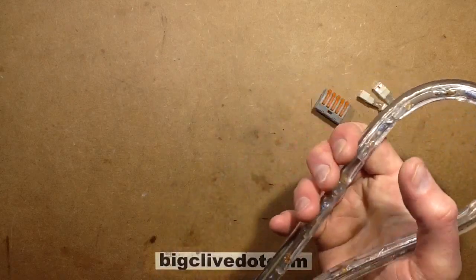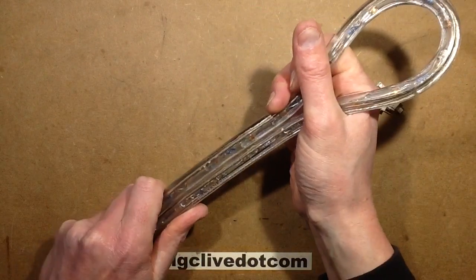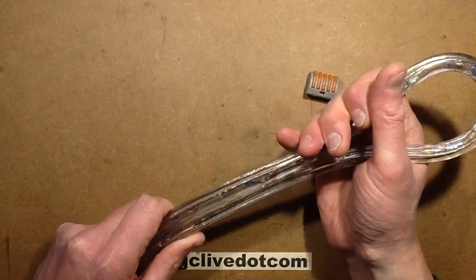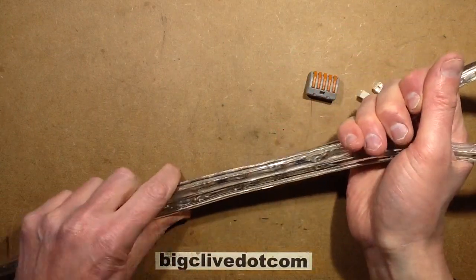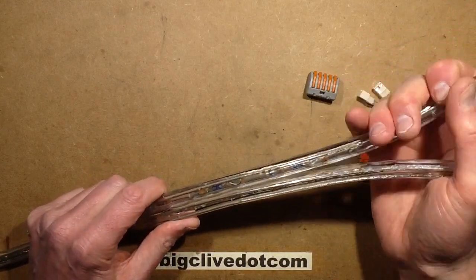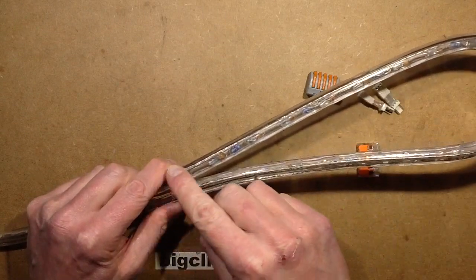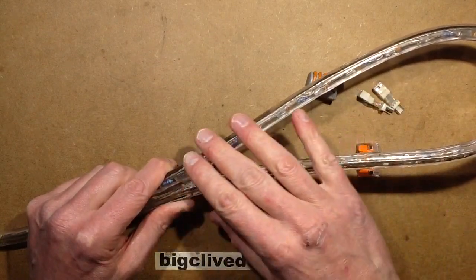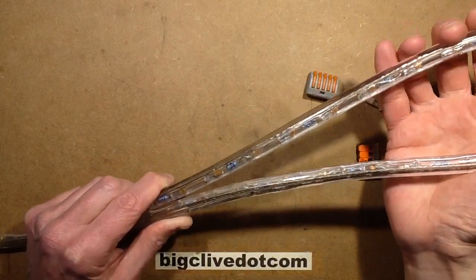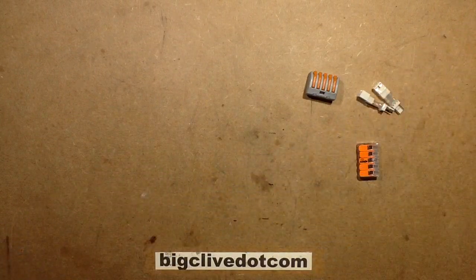It's worth mentioning I did the single outline of the LED tube light. Normally in municipal lights we use a double outline — the reason being it increases brightness, and also means that if you go around the outline once and then again with the same section of tube light, if a metre goes out — and generally speaking when tube light fails just one metre section goes out — then the chance of that metre eclipsing itself on a particular effect is fairly low. So although one metre might be out, the other side of the section is still lit. It's basically a built-in redundancy.